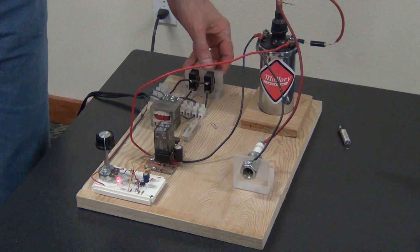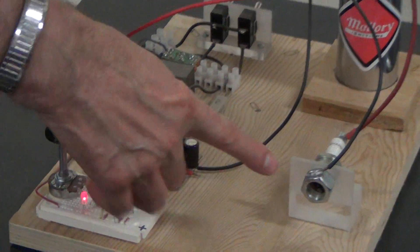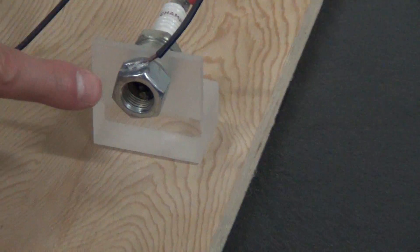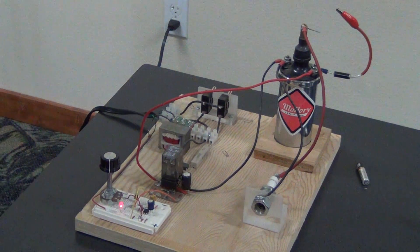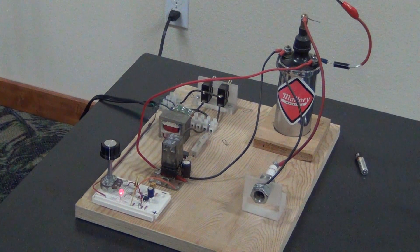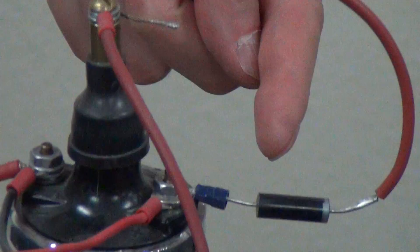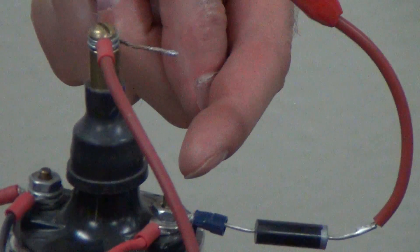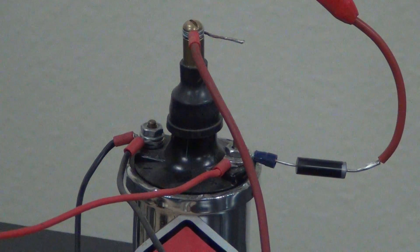Here's what happens. When the capacitor discharges, you can see that's the standard CDI — capacitor discharge ignition. We make one minor circuit modification: we drop this high voltage diode simply between the low voltage positive up to the high voltage positive. We just add that one component.